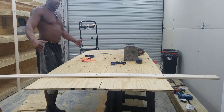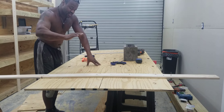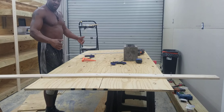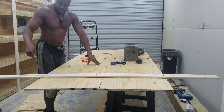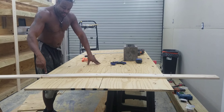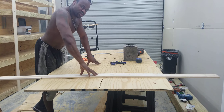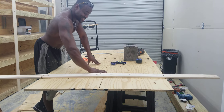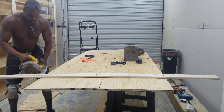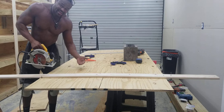On an eight-foot cut, you've got so much space in the middle that the guide can tend to rise up. I'm going to make an eight-foot cut right now. You put your two screws down at the ends on an eight-foot cut, and then towards the middle you put another screw at about 25% in and another at 75% in, just to hold your middle section tight to the board. You want it tight so that when your saw's edge is sliding against the guide, it doesn't slide under it.